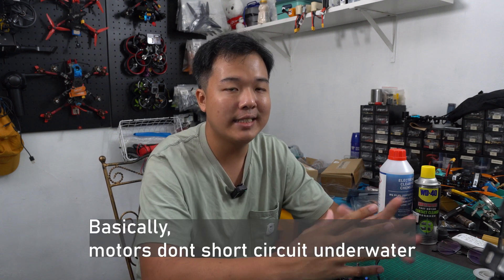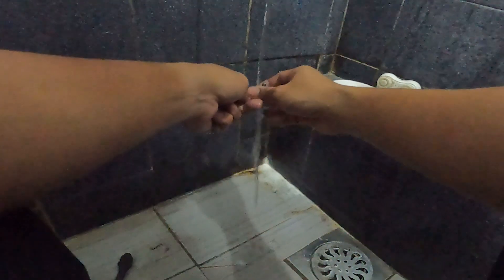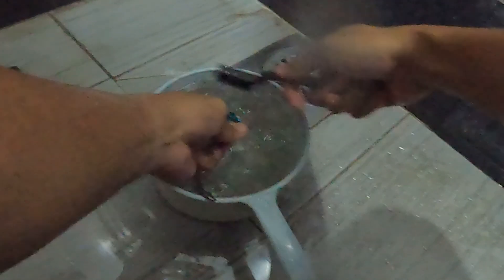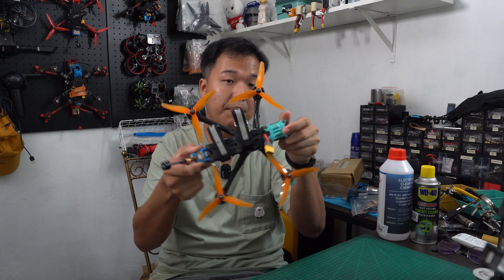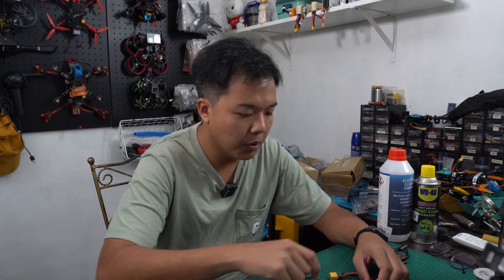When it comes to motors going underwater, the only problem is when gunk gets into them. The motors are not connected to the ESC's DC because we're using brushless motors — it's AC. Run the motors through water, brushing thoroughly and cleaning as much gunk out as possible, then bring them to dry. Do not use isopropyl alcohol or contact cleaner on motors, because they have bearing oil in them that you don't want to remove. After drying, assemble and use them — these motors have been underwater and I'm still using them today, still smooth with no problems.